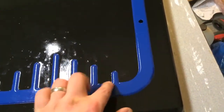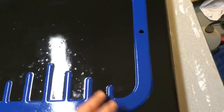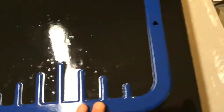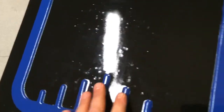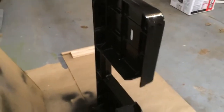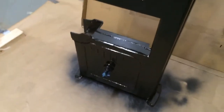What I did was paint all this black first, then went back and taped around these parts. I was originally just going to paint this whole thing blue, but this is all gloss blue over a black base. I only did two coats of black and then two coats of blue, and I didn't sand or wet sand in between. The paint actually dried pretty fast. This one has some pitting, and the bottom one has quite a bit more pitting on the face. I'm going to do the same taping and blue paint treatment on the bottom aluminum casting part of the bandsaw as well.